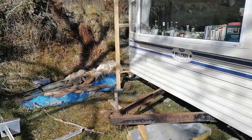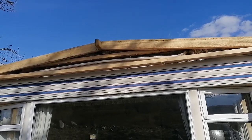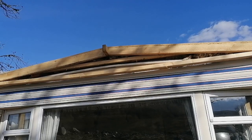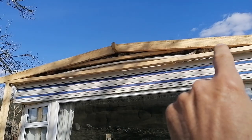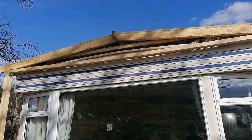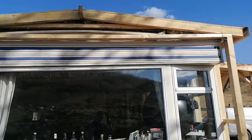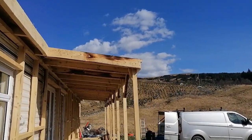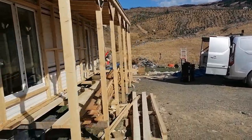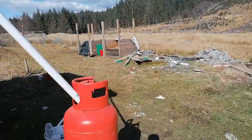You can see the timbers up there — I shot a little bit of video of me cutting the rafters to explain how that was done. There's another timber in there, about two-by-two — that's all I had room for — and that's acting as what's called a collar. When weight goes down on the roof, it's attached to the rafter at both ends and stops it spreading outward. So these roof timbers on this side are all that length, and on the other side the next ones along are extended out about a meter and a half.